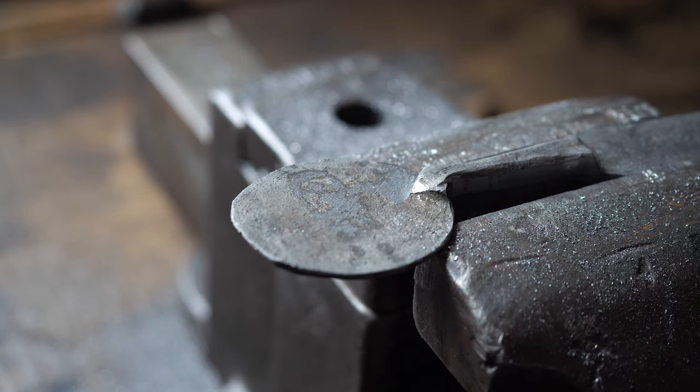From there, once I have my channel about the depth of my inlay material, my selected inlay material should have a slight trapezoidal shape to it around the edge here. As you can tell, this is not a 90 degree angle. So the slight trapezoidal shape is going to come in handy later, because once my channel is established, I will then create an undercut. And this undercut is done with a chisel that will also raise up a small burr. This small chisel that I'm going to use along my established channel is going to create not only a dovetail, but it's also going to raise a small burr on the top surface, which will allow for me to insert my inlay material.